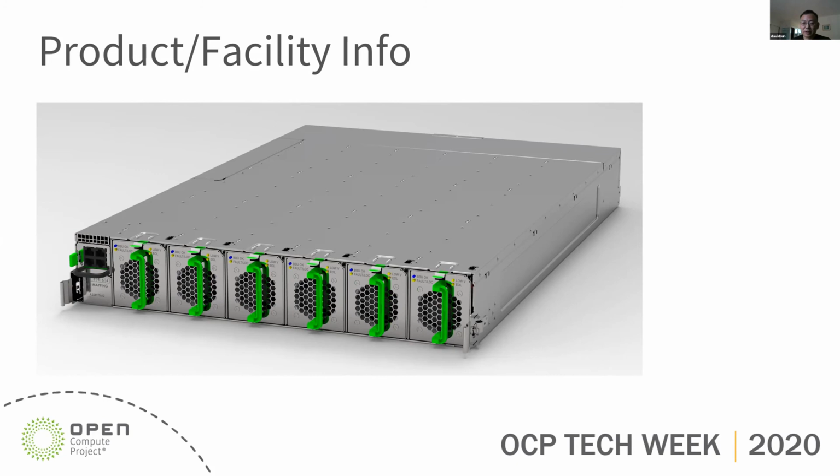But you can install fewer modules in the shelf. For example, instead of 6, you can choose to install 5 or 3 of them, for less power or capacity. And if they want more, they can have two battery shelves in the rack. Yes, that will work. We can use the same idea as the power shelf: we add a share pin, so the two BBU shelves can share current and work in parallel. That will provide more wattage and capacity.